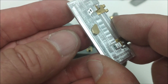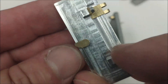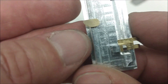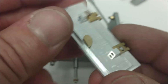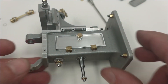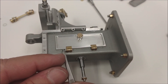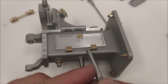If anybody is curious about this little cam I made for the locking mechanism — yes, it does lock. There is an undercut inside the door channel where this comes around, swings around, goes right in it. Matching radius. It is an offset point of rotation, or this would just slide right out. And when it is at rest, it falls within the boundaries of the door frame so the door will open and close. Thank goodness for CAD. For anybody that didn't watch the entire series, this door is not part of the model — it's not part of the kit. This casting was solid when I got it, and I just said, nope, need a door. So now we've got a door.